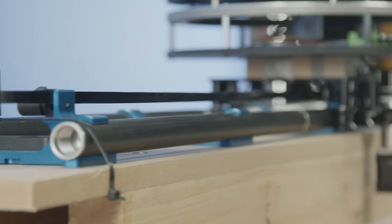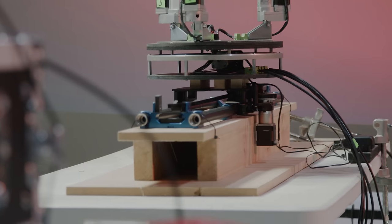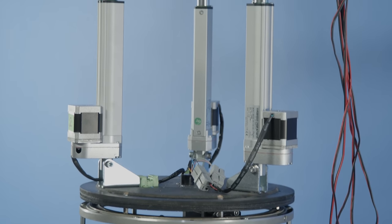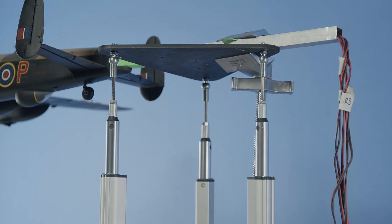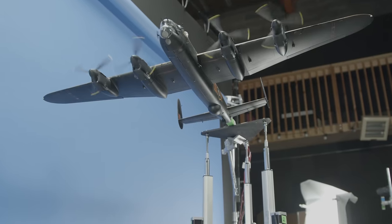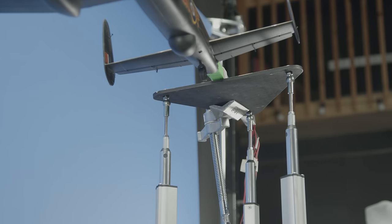That's sitting on top of an old DSLR time-lapse slider — a pretty standard rail mounted slider with a motor attachment. I put the turntable on top of that, and then on top of the turntable itself I've got three linear actuators which are stepper motor controlled. They're very similar to the kind of linear actuators you have to open garage doors or reclining electric chairs. It's a sort of telescopic type action. They've got a really good holding torque and can hold and move some pretty impressive weights at good speeds. What makes these slightly unique instead of the big DC motors which are the most common ones — these are actually stepper motor controlled, which interfaces with our system perfectly.